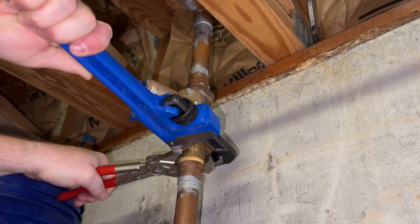To adjust the pressure on this model, you loosen the set nut and go clockwise to increase the pressure and counterclockwise to decrease the pressure. This is important in adjusting: if you want to increase the pressure you can adjust it and it'll let more water in, but if you want to decrease the pressure there's nowhere the water can escape, so you're going to have to release some and then check your pressure again. We got it right at about 60 psi — it dropped below by less than 1 psi, so that's perfect. Now tighten up your set nut so it doesn't go out of adjustment.